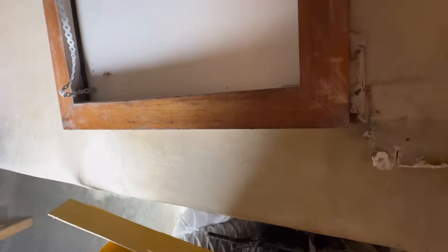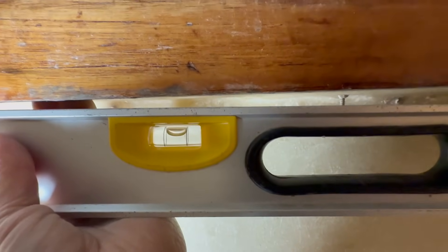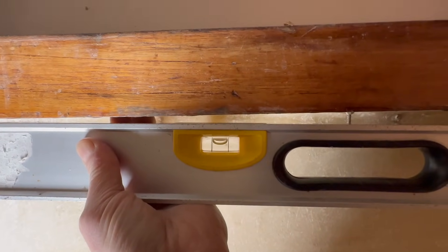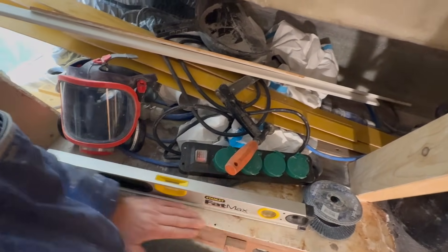The floor and pilot house is about water-leveled, but if we look at the door it's not straight at all. The stern needs to go further down for it to be straight, but if we look at the window it's okay again. I have to take some measurements and make a decision. My decision is to follow the floor, not the door — it will probably be okay most of the time, it's not far off.